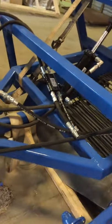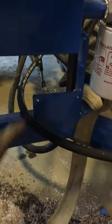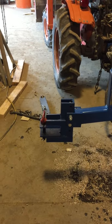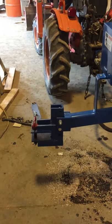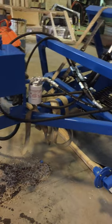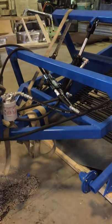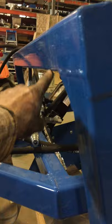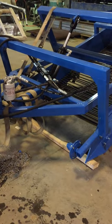There are some hoses laying in there — those are the cylinder hoses that come with it. The standard position for the flow control is right there and the person on the back can't fiddle with it, which is nice. This clevis for pulling can be adjusted up and down, then flipped over and adjusted up and down again, giving plenty of range of motion. That helps you adjust your dig depth, your maximum dig depth, and also the clearance of the tongue over the crop. With the tongue coming up, this will dig super deep — deeper than really anything I've ever dug.